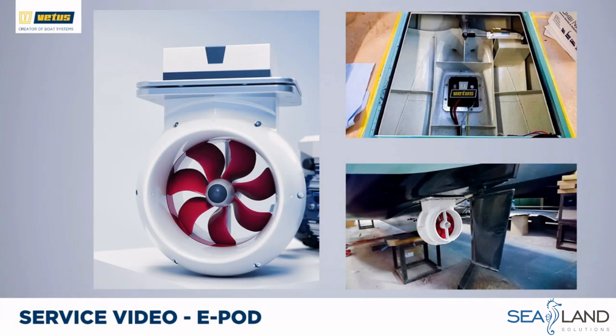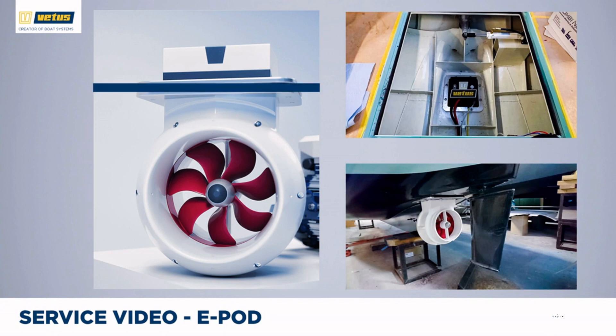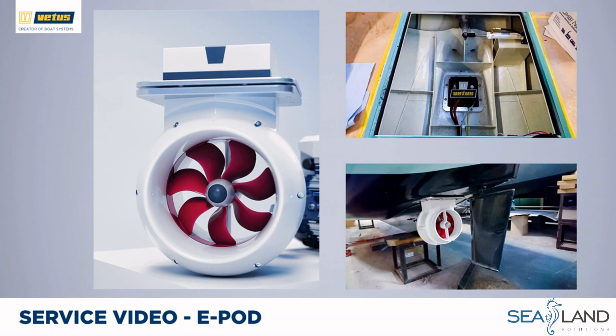The e-pod is a completely different solution. Most of the e-pod motor is fitted underneath the waterline. The blue line in the image represents the bottom of the hull — anything below is under water, anything above is inside the hull. On the right you can see the white e-pod and a rudder blade, all mounted beneath the water level. The top picture shows the boat with the companionway sole removed, and you're looking at the top of the e-pod — that's all there is inside the boat. It frees up a lot of room, and many naval architects really like this solution.